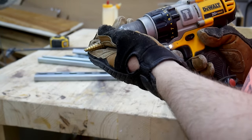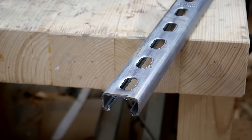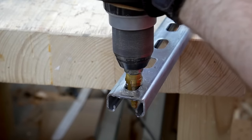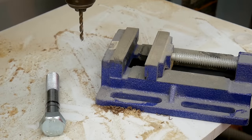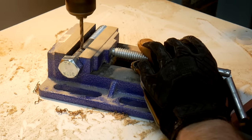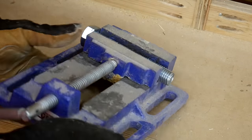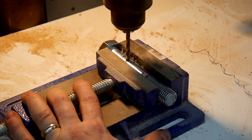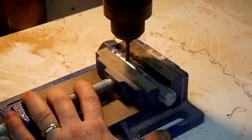Most of the hardware I'll be using for this project is half-inch bolts and nuts, but I do have one three-quarter-inch bolt that I will be using — that's the special bolt that will have the perpendicular hole drilled and tapped, but more on that later. Right now I'm using a step bit to expand one of the holes on the Unistrut to accept that three-quarter-inch bolt. The whole principle of operation of this three-way clamp revolves around the manufacture of this bolt. I take a standard three-quarter-inch grade-two bolt, find center roughly using the tip of my drill bit, drill a pilot hole, and follow up with the 27/64ths hole needed to tap with a half-inch thread.